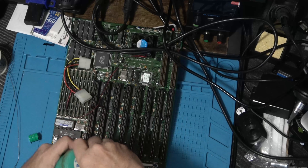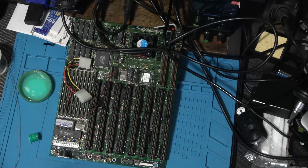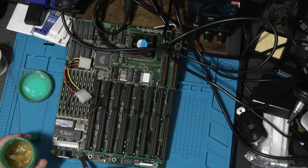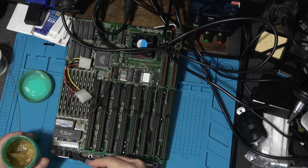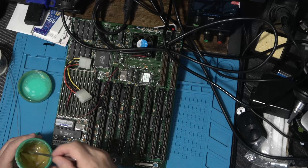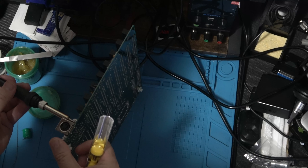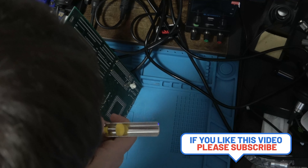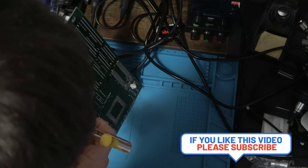Let's get some of the paste on. Here's where you've got to put some paste. Now, the thing with these old motherboards — people need to understand things were way different back then. The solder they used is terrible. Getting it off was quite a chore just to get the holes free and put the battery back in. It took me so long. I had to cut out so much of this video just for this part, just to get the holes to be holes again to get the thing back in. It's a really heavy, weird grade of solder they used back then, like a heavy lead base.